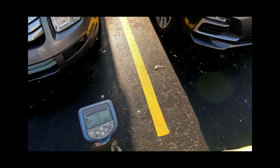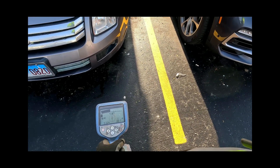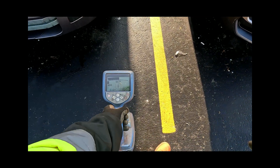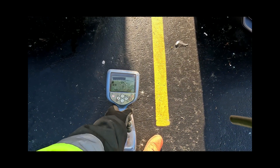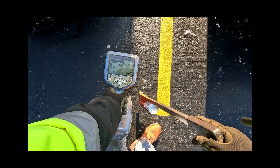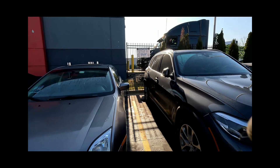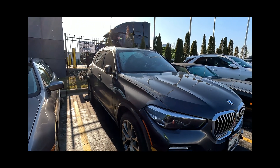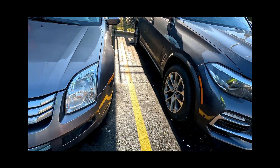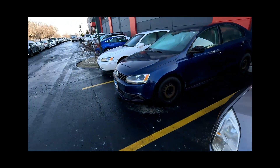And you can see where it jumped up. I didn't move my gain up at all — I just left it where I had it at 55, and I had to bump it down because I picked it up. I'm reading 60 milliamps — so that's a really good tone. I got 60 milliamps going one way, 20 going west, so that's 80 total. I'm losing about 20% of my milliamps somewhere, so I've got to find out where the other 20 is going.